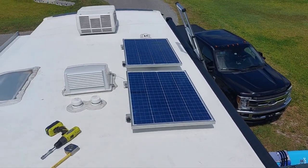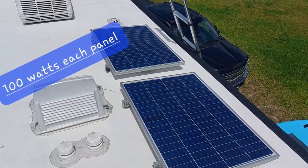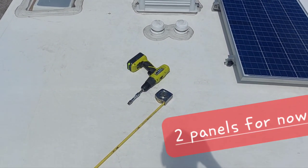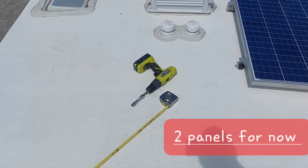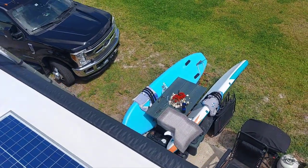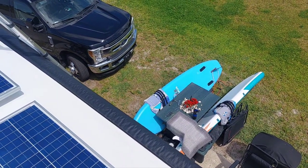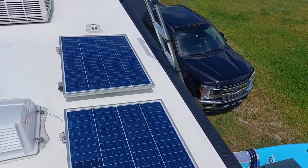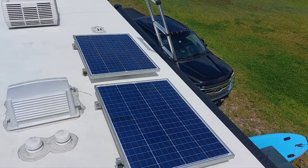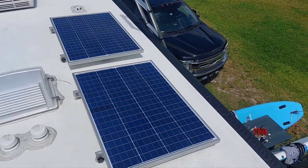There's the first two. I'll wire them up and it's going to be good to go. My thing's hooked up inside, which is really nice. It takes a cordless drill with a 3/8 bit, a socket — number 10 — and a small crescent wrench and a ratchet. That's it. Really good instructions. I'll hook the wires up later on, and I've got to do some caulking — I'll put caulking everywhere I drill and fill it pretty good with my self-leveling caulking.